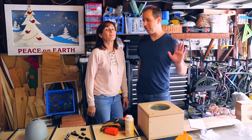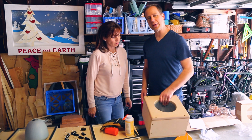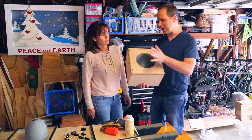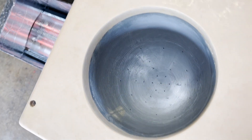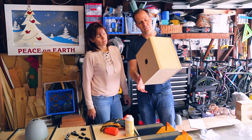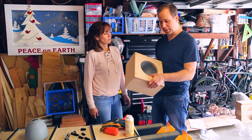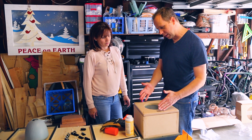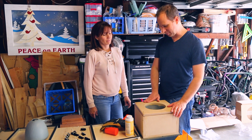After a bunch of work, we have a new mold buck for negative vacuum forming. It's a negative mold, so the plastic is going to be sucked in. You can see there are some little holes down in here that will suck the plastic in, and we've got our hole on the back for the shop vac. Hopefully this will be easier to release since when the plastic cools it'll contract inwards. So we're going to give this a try and see what we get.